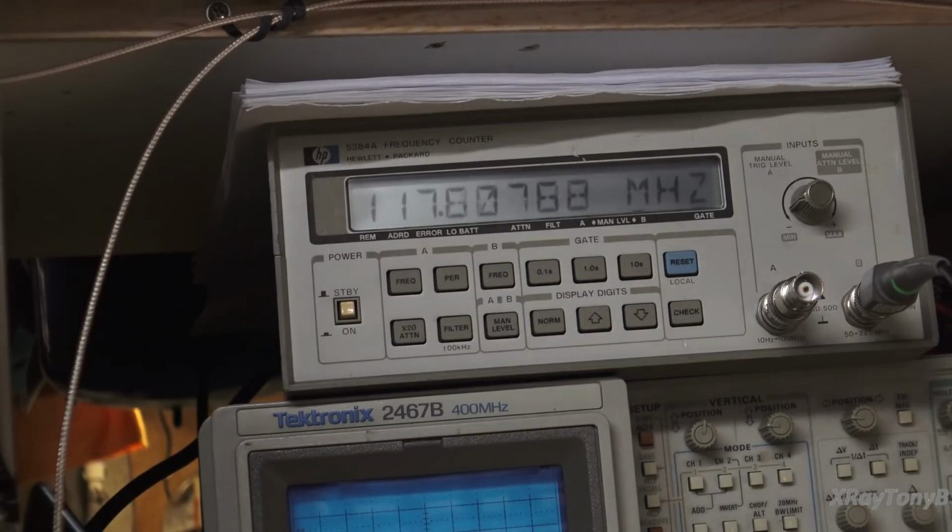And this is actually a trimmer capacitor, TC6. So the capacitor might be a little bit flaky, or just might have some crud on it or something. So we're going to try to adjust that and see if we can get our 110 megahertz. The other one, I did adjust that L6 coil, just barely touched it, and it brought it right in, and it was barely out.